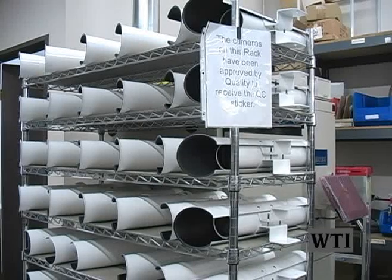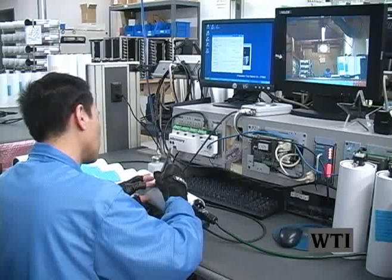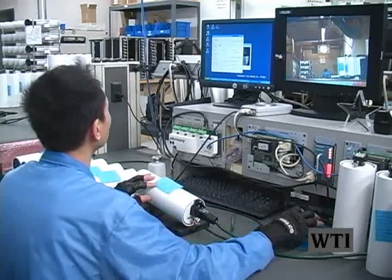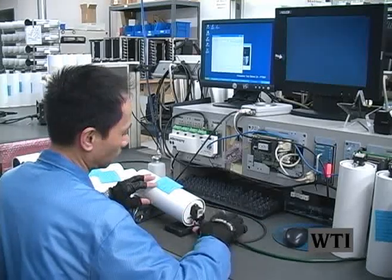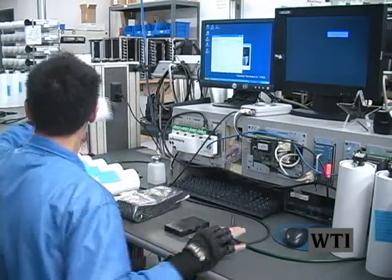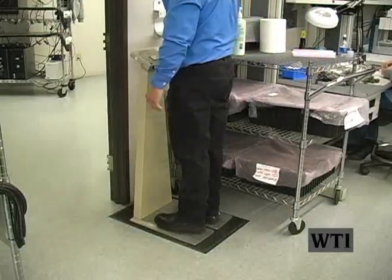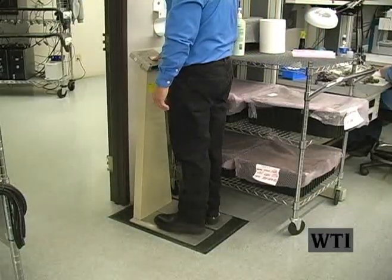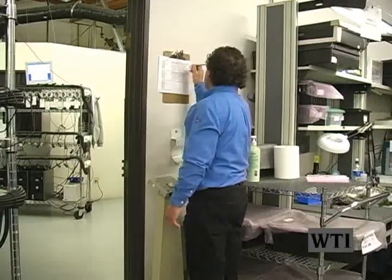A real-time video during a typical workday of the manufacturing plant. In a typical workday, everyone in the camera production department puts on an electrostatic discharge (ESD) blue smock, and then puts on either a wrist or foot strap, and then heads towards the dual footwear and wrist tester machine. When they pass, they enter their initials in the log sheet over the testing equipment.